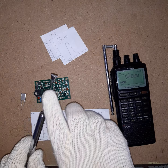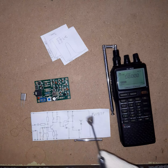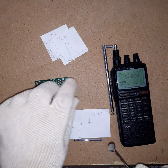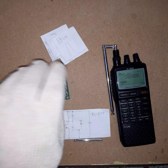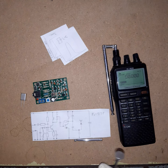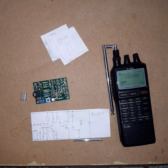Of course, like I said, much longer than this. This is just an example, but not the full length. At a specific length, I did get the most signal strength, and that plays into the cards of the transmitter, if you will, because most people would just hook up a random wire as antenna and throw it somewhere, which is not tuned, whilst I gave it a tuned antenna, giving it an advantage in the measurement that followed to get a good result. If you measure the spectrum of a transmitter, you want to have something that looks at least like that. I tuned for the middle of the FM band, and I got best signal there.